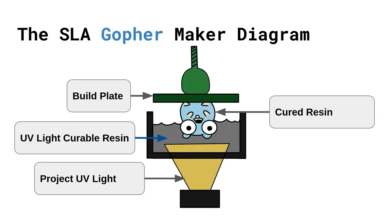In contrast, the SLA 3D printer works kind of in the opposite way — instead of the input material going to the build plate, you have the build plate going to the input material, which in this case is a liquid: a big basin of UV-curable resin. The build plate lowers down into that resin at a certain height just above the bottom, then a UV light projects a certain shape onto the build plate, curing it. It rises and lowers again, and does this until out of the nothingness rises a perfect-looking gopher.